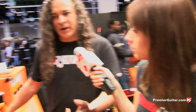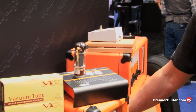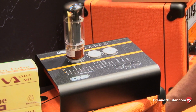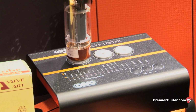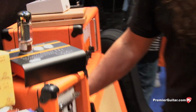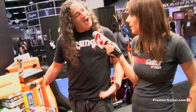With power amp tubes, in case you didn't know this, power amp tubes generally are grouped into 3 different types of tubes. The first one is early distortion, then there's average, and then there's late distortion. Basically in your lower wattage amps where you want it to be warm and break up earlier, use early distortion. On your middle ones, you use average distortion. On a higher gain amplifier where you're using the cascading gain in the preamp, you do not want that much power amp distortion until you get to a concert volume where I want a little bit of that.